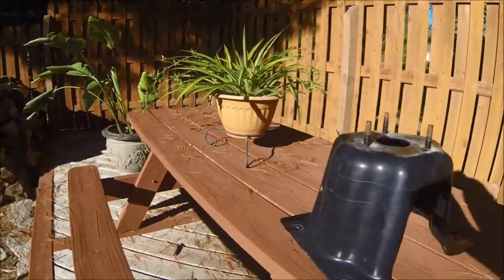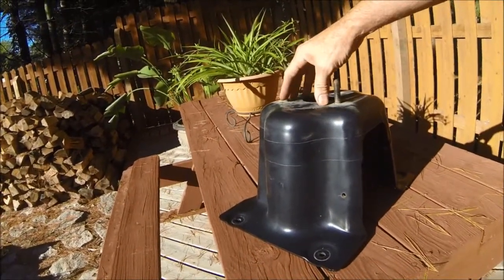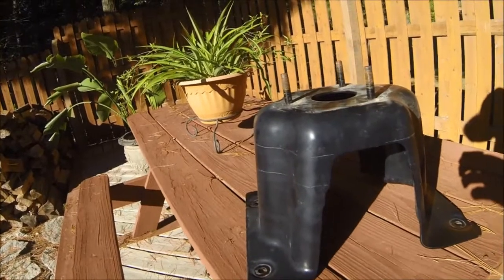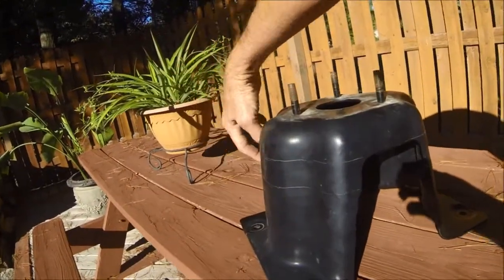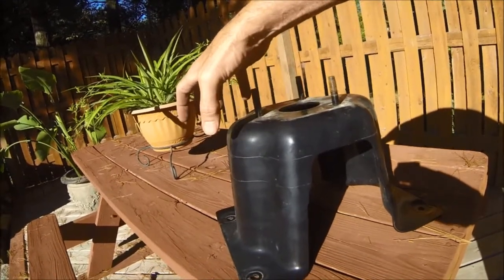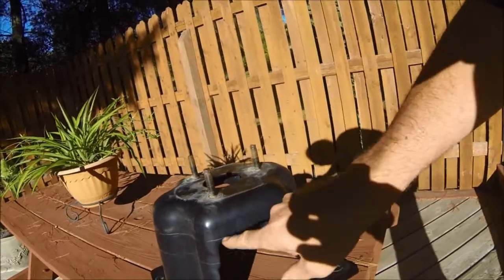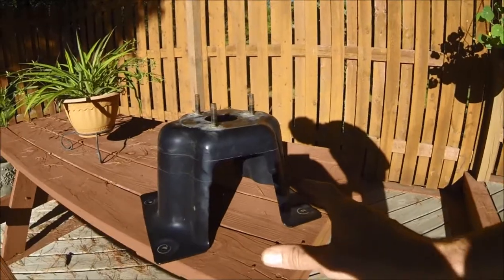I have taken the bracket off and got it out here in the sunlight to show you what I plan to do with it. First thing I did is take a 90 degree triangle and go off this flat surface, scribing my cut lines all the way around — that will keep my grinding to a minimum when I go to put a plate in there. What I plan to do is section this out, cut this inch and a half strip out, weld in a plate leaving some more sticking off the top, and then weld this back on shifted about two inches higher. Before I cut things loose, I'm going to weld in some temporary straps on both sides, because once I make either of these cuts it's going to become three pieces and I want these two pieces held in position with each other.